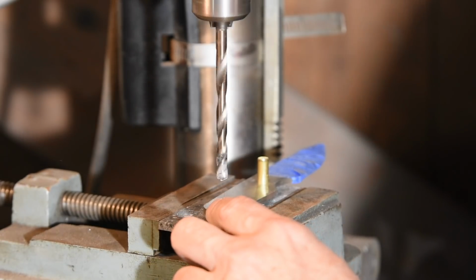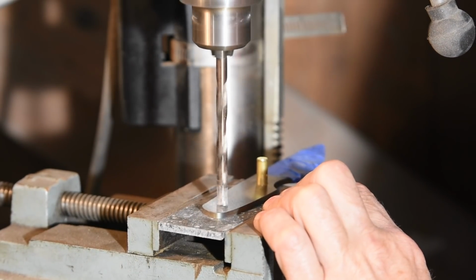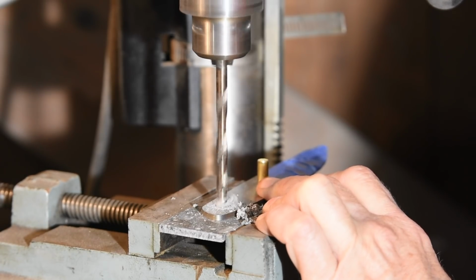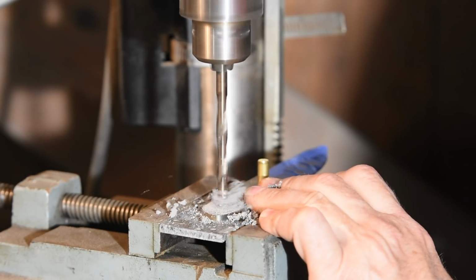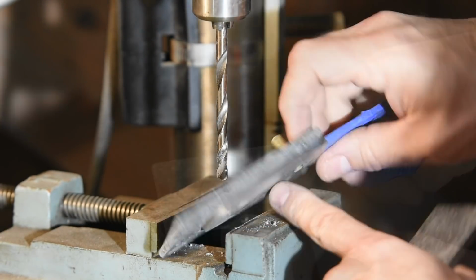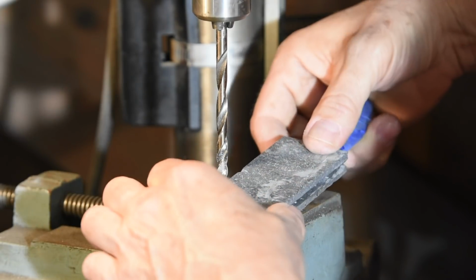By drilling each hole in turn, then using a locator pin to assure that the holes are exactly the right distance, you can go sequentially 1, 2, 3, 4 through those holes and get them all to line up properly. When you flip the blade over, make sure you drill through the previous scale so as to make sure the holes are at the same angle.